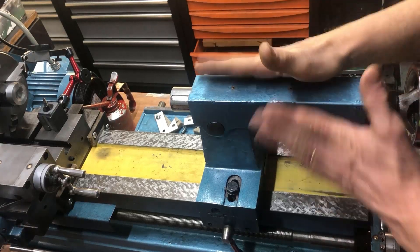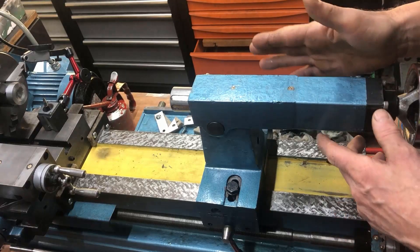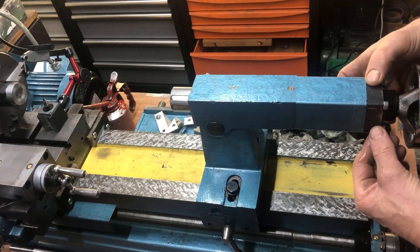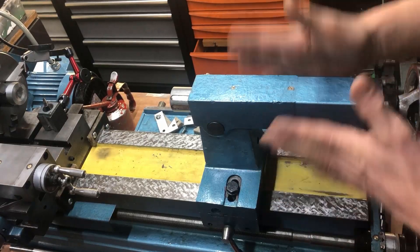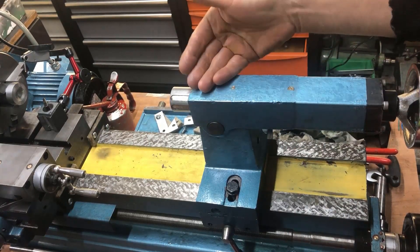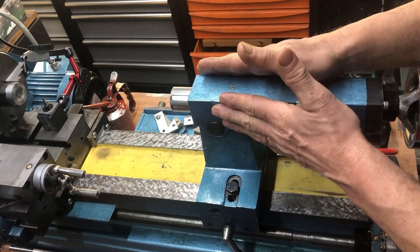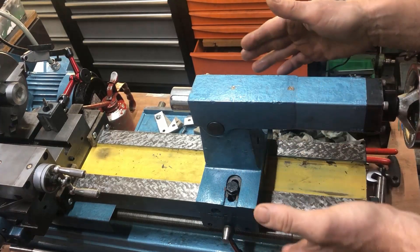Today's topic is the tailstock of the Smarty. I have lengthened it, as you can see, and I've also introduced a pair of thrust bearings at the rear. I wanted to divide this topic into two parts: showing how I did the lengthening and the thrust bearing, and then the setup, measurements, adjustments, scraping, and such — which is more general.